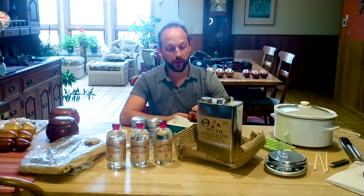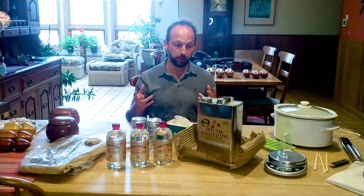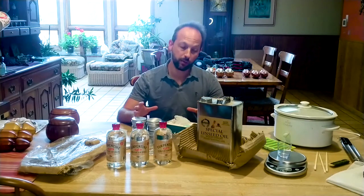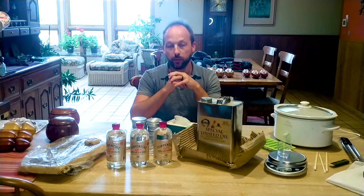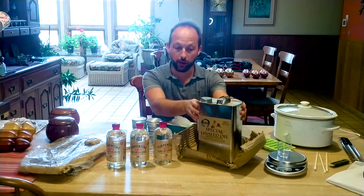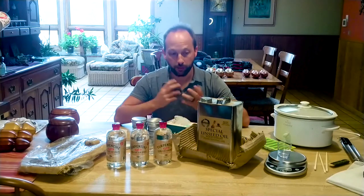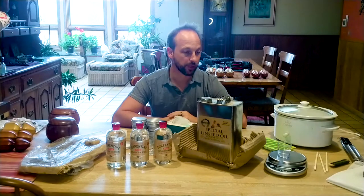So the way they used to make boiled linseed oil before chemical drying agents was actually to literally boil it, and they don't do that anymore. So when you go to the hardware store, you get boiled linseed oil. It hasn't been boiled. It's been altered with chemical agents. But what you can do is find someone who's boiling their own and polymerizing it. You can get pre-polymerized linseed oil.